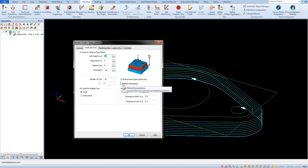To enable machining on helix in the contour machining operation, here in the Levels and Cuts tab you must check the helical interpolation option. With this option the pitch parameter is associated, in which we determine the helix pitch along which the tool will move. Let's enter here, for example, 1.